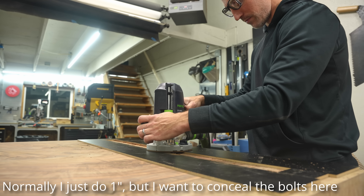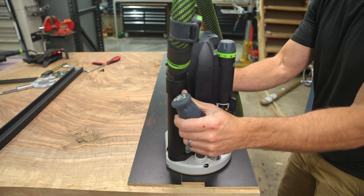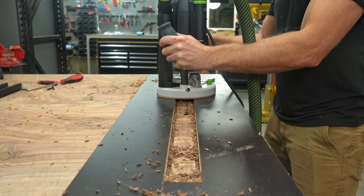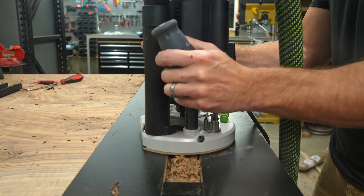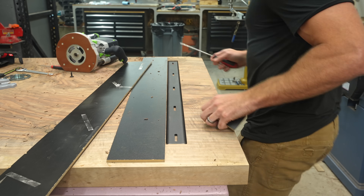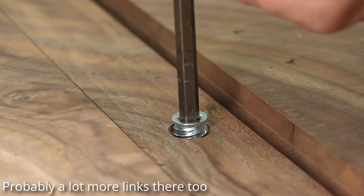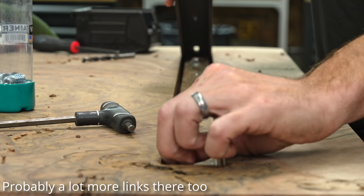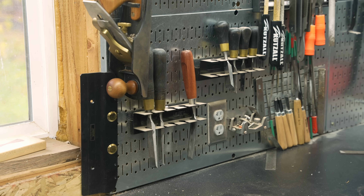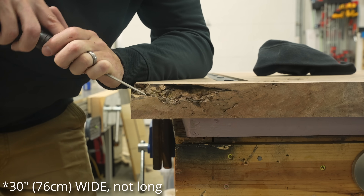I get a lot of questions about these C-channels and I tend to leave this process out of a lot of videos, so I'm bringing it back. The biggest misconception is that people think it makes the wood stronger — I assure you this wood is plenty strong. The only thing these C-channels do is mitigate wood movement in the form of cupping and bowing. I get these from Concept 13 — they're made for woodworking. You add threaded inserts, tighten them down with flat-headed Murakashi-style bolts, allowing the wood to move around the C-channel. On any slab over 30 inches, I highly recommend putting them in.